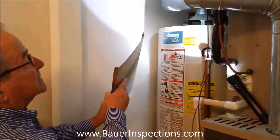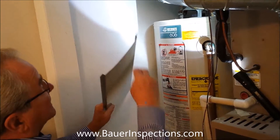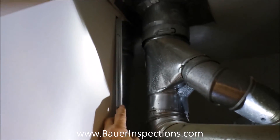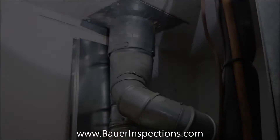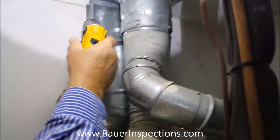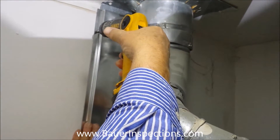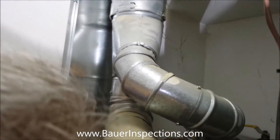This here is a heat shield — it's a piece of sheet metal with an offset to bring it away from the wall so that there's an airspace behind it. We'll put it up here like this to protect the wall, placing it up and putting a screw through the pre-drilled hole and into the drywall.